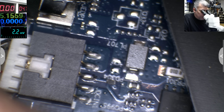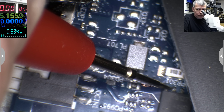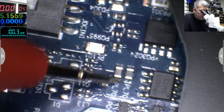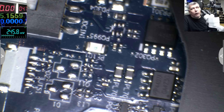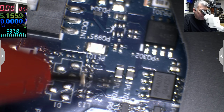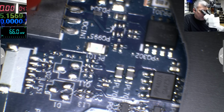You can figure it out: the output is 0.8V, which means it's not a short. We have fuses, carbon resistors, inductors — I forgot the name. And you have the first MOSFET, after that comes the second MOSFET, then the current sensor, then another inductor, and from there is your main 19V power line.